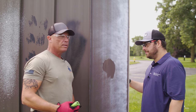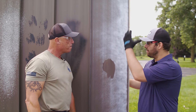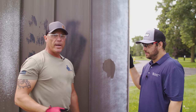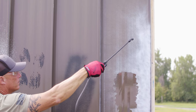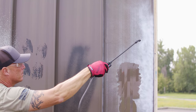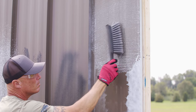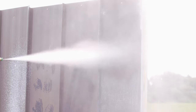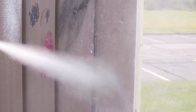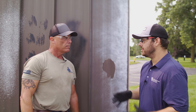Once you know the product works, start from the top and work down so water runs into the gutters and landscape. For a large area, put Clean Sweep into a small pump sprayer and apply it in a waterfall effect — don't just mist it, put on a good coat. Agitate with a very soft deck brush, then rinse with a pressure washer. Keep the pressure washer a foot and a half back with a 15-degree tip just to rinse — too much pressure can damage the paint.